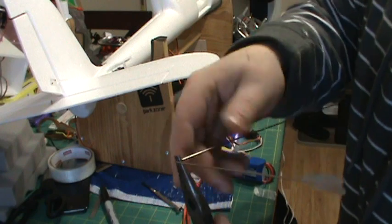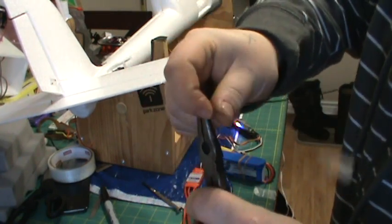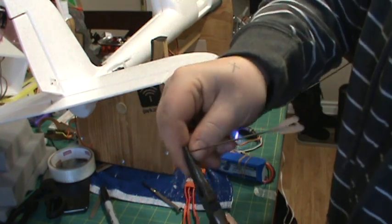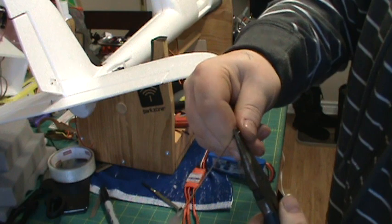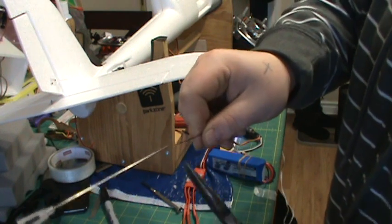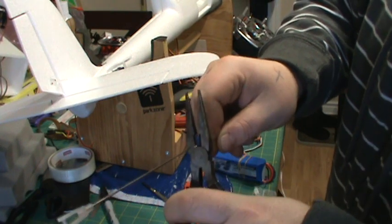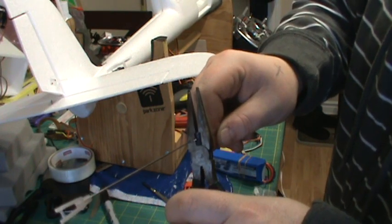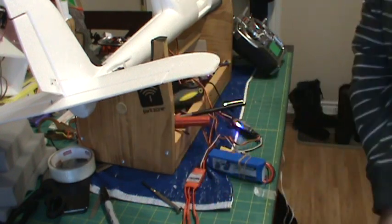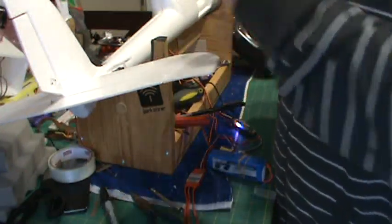Make our Z bend. So we've got 90. And nip it out a little bit closer to the tip so it makes a tighter bend. I'm going to bend it back this way. Like so. And now we can cut it, just back there a little bit. These snips are not the greatest, but they work. So now we have our Z bend.